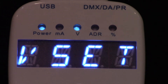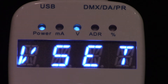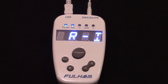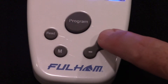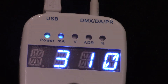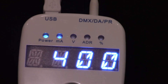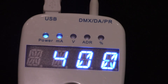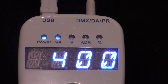An indicator light will also appear over MA or V to indicate which attribute you're currently setting. Press the Read button to display the driver's currently set output current or voltage. To program a new value, press the Plus or Minus button to change the desired current or voltage — hold the button down to change the value faster. When you've reached the desired value, press the Program button to lock the value in. You can press the Read button again to confirm that the driver has been set to the new value.